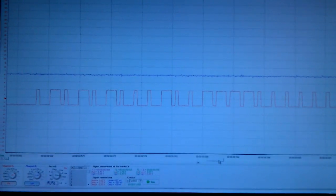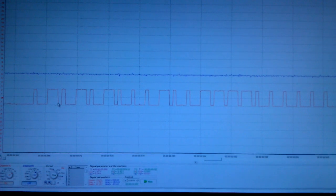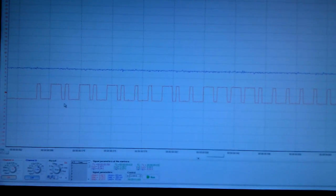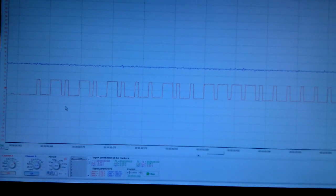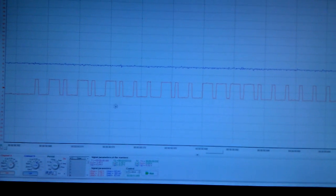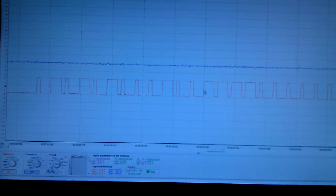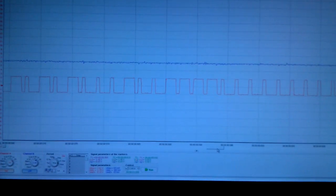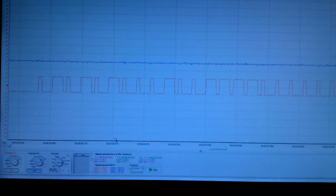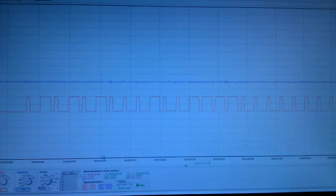based on the data sheet of the encoder, you can make out that a small pulse followed by a long pulse here is considered a floating bit. So a floating bit is when the microcontroller pin is not connected to either the positive or the negative of the power. And if you look at this signal here, 2 small pulses, that's considered a logical 0, and then these 2 large pulses is considered a logical 1, right? So based on this pattern, it's fairly easy for us to actually develop a microcontroller program which can read this data, interpret it, and interpret it for every specific dip switch setting or the pattern.